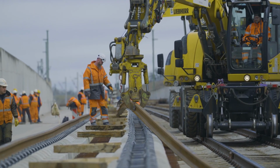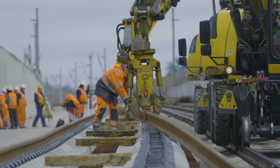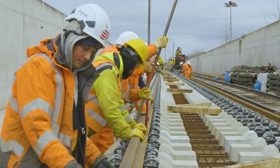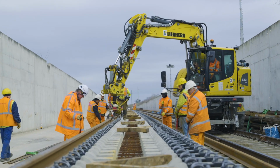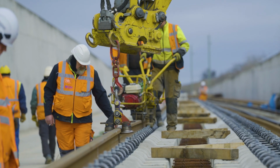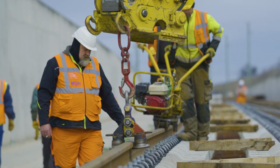The 2 long welded rails are then lifted onto the rail fastening system using 2 excavators with manual aid and the tensioning clamps aligned. The excavators run on a parallel temporary logistics line. The tie bolts are mechanically tightened and the rails fixed to the ties in this manner.